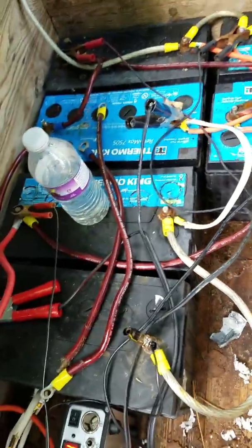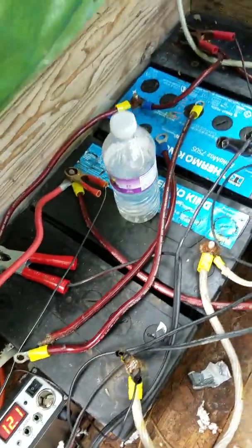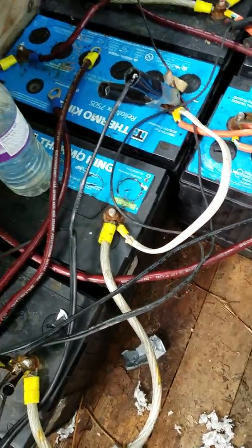Then I'll switch the solar over too, and move the other two batteries back to this charger until they're full, then switch back. Instead of running a million batteries and not getting an even charge, I'll keep it flowing and rotate the banks. I'll be switching battery banks back and forth. The big one stays because it's already wired — it's simpler to just hook up two of them. I've got two large, heavy jumper cables here, so balancing those two shouldn't be a problem.